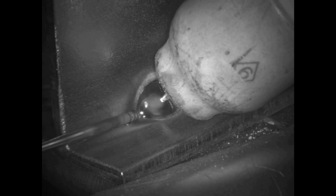Now the end. Strike there again, get it liquid. Do little circles to get the width you want, and then start dabbing. You can see right there the bottom's not fused — I backed up and then went over it again. You've got to recognize when it's not fusing; you've got to change your angle, get it down on that bottom plate and get it to fuse. Maybe back up a little bit like I did. Now we're getting to the end — extinguish the arc, do little circles until the liquid goes to solid, let that post purge, keep the atmosphere out of there.